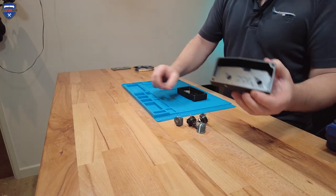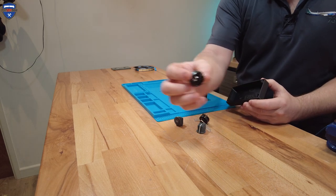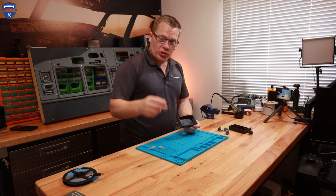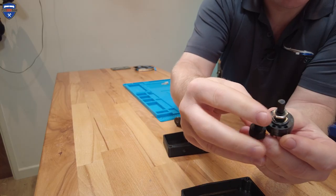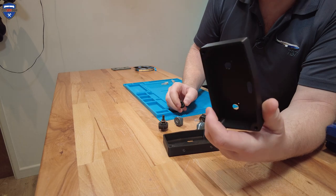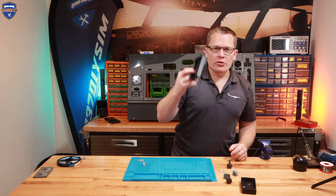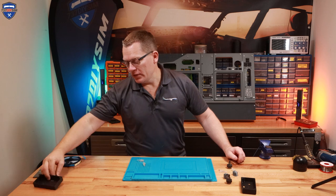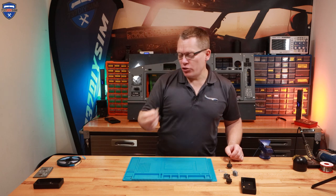The large version fits the larger 8-position rotary switches at 45 degrees. Then we've got the smaller version, which takes these tiny 16mm rotary switches — they are a lot smaller, but they do the same job and work just as well. This is called the DUS, for small version. For this build video I'm going to put the smaller one aside, but note that they are cheaper, easy to get hold of, and there is a set design for that. It also has its own adapter shafts to fit.